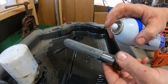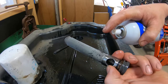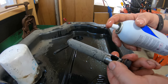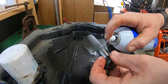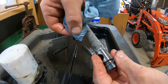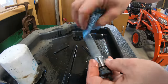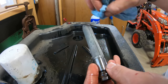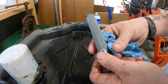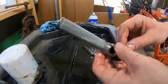I've got some carb choke cleaner here — you could use brake clean or any kind of cleaner you want. Spray this thing off, making sure to spray towards the edges to blow off the debris rather than push it inside. Then we'll use a blow gun to blow this thing nice and dry and make sure we've got every bit of contaminants off the screen. Some of the debris is definitely embedded in there, so I'm having to rub some of it off.